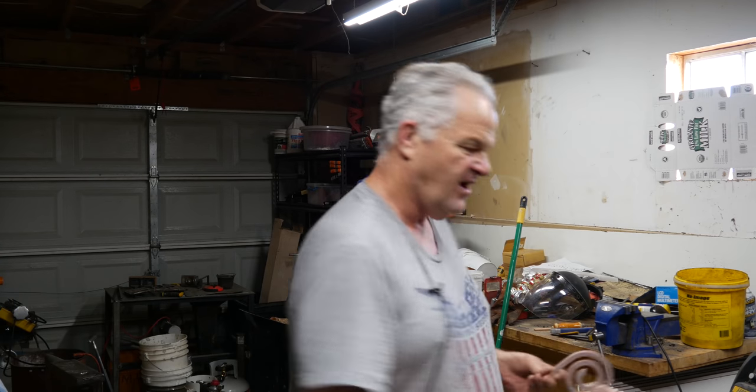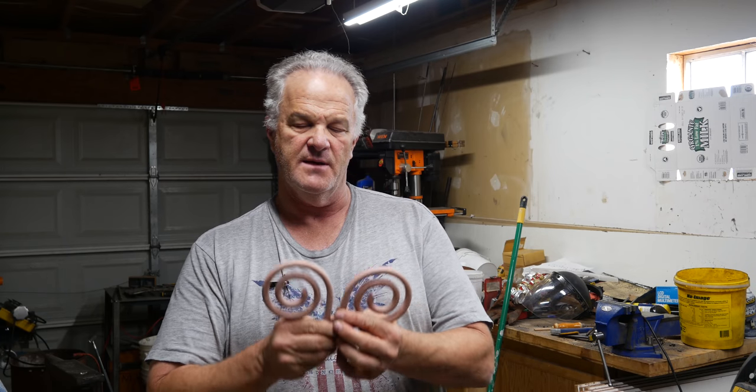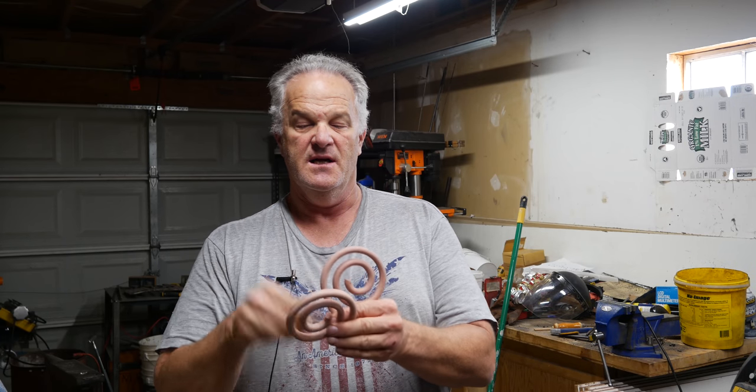These guys are typical things for testing fluidity, categorizing their fluidity, measuring fluidity, that kind of stuff. Fluidity is not defined in casting terms as the inverse of viscosity. In other words, it's not how runny things are. Fluidity is defined as how far it will flow.